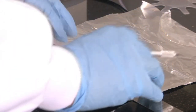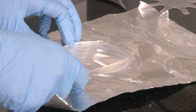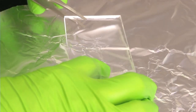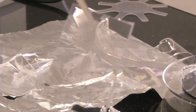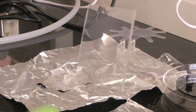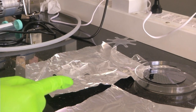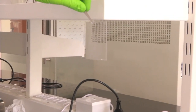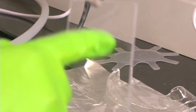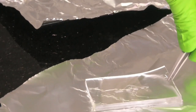We have made all four cuts with a metal scale and will now remove the extra material around the rectangular portion. We have peeled off the extra PDMS membrane and made a rectangular portion for our device. Make sure that you do not reach with your tweezer to your device area - keep it far away. You can see the device here. Make sure you do not contaminate it with air, so we have to quickly pack it in aluminium foil and store it for use.